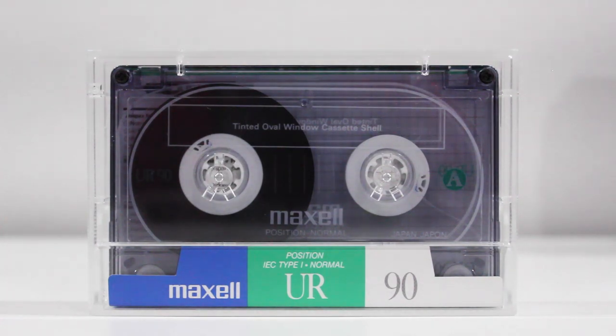And in terms of the level, it was rather saturated. You could hear in the tape that some parts were definitely a bit overdriven or distorted, even at just +3, and +3 is really not that much. So on this type of deck, on the Pioneer meter scale, it's probably recommended to record around +1 or just 0, because there were definitely signs of distortion and saturation at +3. And I believe I said this just a moment ago, but there was quite a bit of noise. It was quite evident.